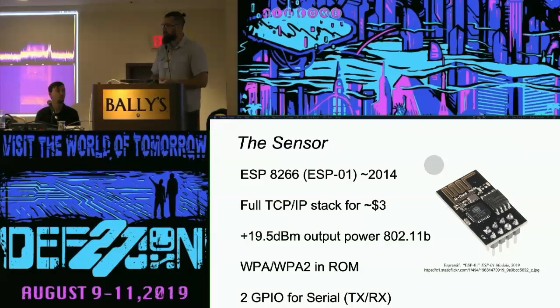These chips were released in 2014 by a manufacturer out of China. Nobody here really caught wind of it except those really into hardware hacking, until Hackaday picked up the ESP8266 for one of their pieces. At $3 you get almost 20 dB out of this tiny chip powered by 3.3 volts. In open space, tests have shown it reaches about 300 meters client to access point — it's got a really good radiation pattern. Even better, the chip has all the functionality needed to run WPA and WPA2, so we didn't have to write that from scratch.